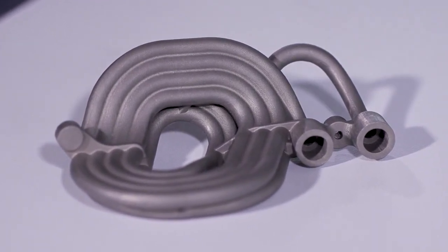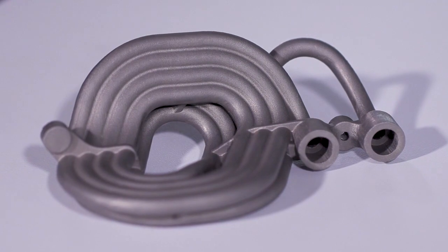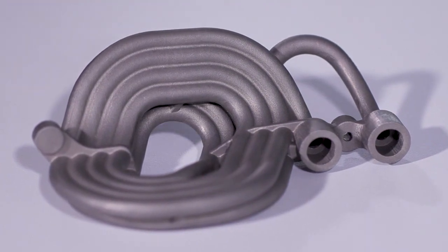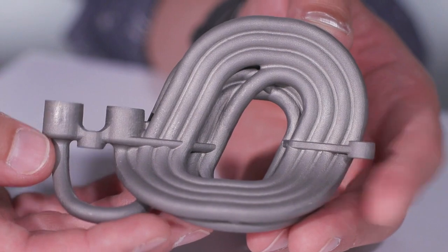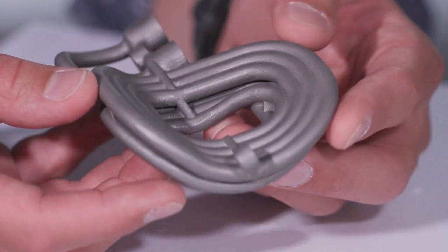Now, if you would traditionally manufacture this, I would imagine there would be a bunch of separate parts that would have to be connected together. Correct — so it's all consolidated into one. You've got your mounting features, the fittings on the end that would likely be brazed on, and then again the tube itself is all coiled around together. The nice thing is you're able to manufacture those tubes in one piece, which allows a smaller consolidation of footprint to fit more in a tighter package.